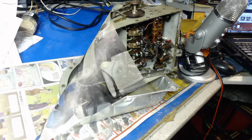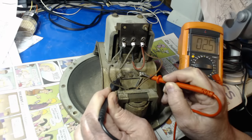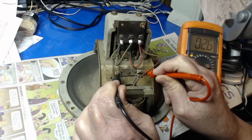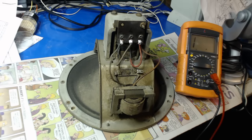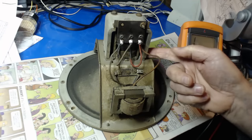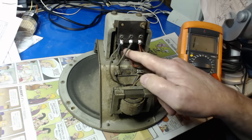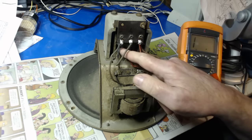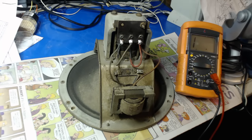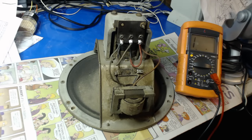You know, it's always something when you work on these old radios. Since this is opened, I didn't check the voice coil, which is right here - let's check that. We got a reading on the voice coil, so that's good. So I was thinking maybe taking this apart - first the field coil. I've never done this before. Maybe there's a loose wire under this tape here, because it doesn't smell like it's burnt and this thing looks in good condition. I was really surprised that I didn't get any readings on it.